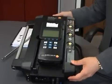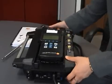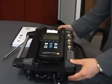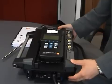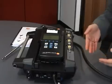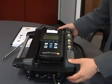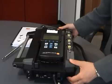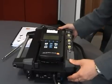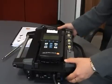This is basically introducing the 350XL from Testo, based in Germany. This instrument is used for stack gas testing; it's a semi-continuous unit, meaning it can do an overnight run with mid-cycles during the measurement. It is also used in optimisation and efficiency of boilers, furnaces and burners in the industry, for process engineers for example.